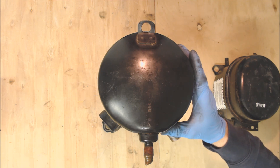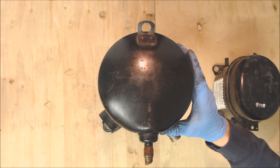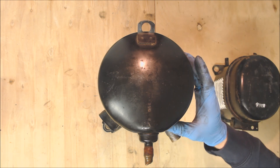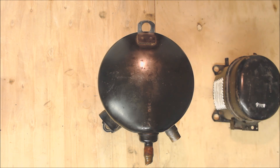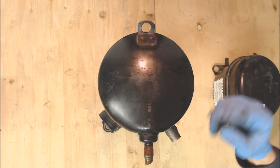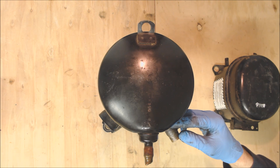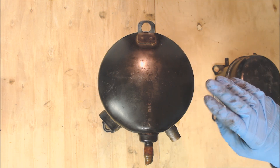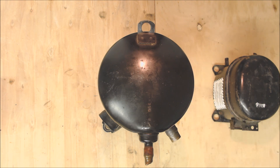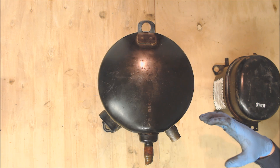Scroll compressors are typically found in air conditioning. You may find these in some of the R22 dry units that were installed, or now all the R410A systems — they typically use the scroll compressor, and they're also using the scroll compressor for newer high pressure refrigerants as well. You can tell a scroll compressor just by looking down at it — you see that it's round. When looking down at it from the top, you'll also notice that the discharge is on the side up on the top, and then you have your suction right here. You'll also see that the scroll compressor is tall. It won't have an accumulator actually mounted directly to the side of it like the rotary compressor does, although it could have a suction accumulator mounted from the suction pipe over on the side.